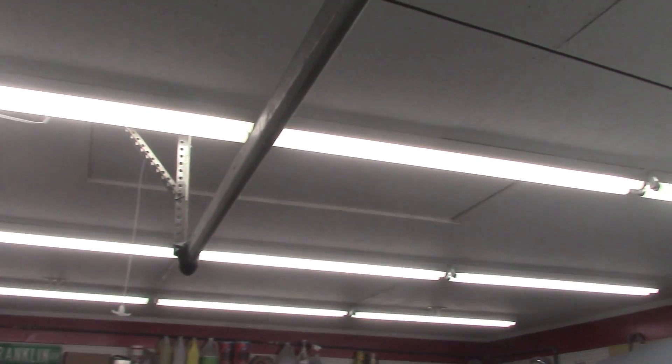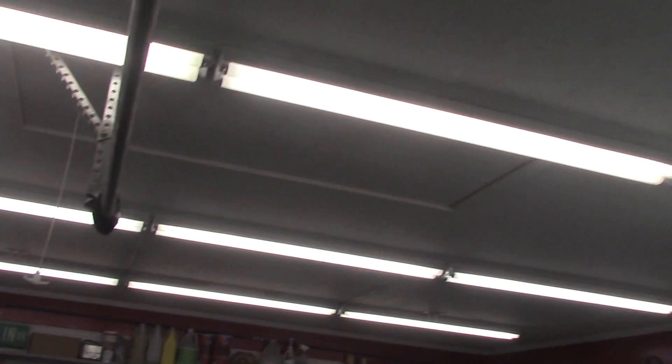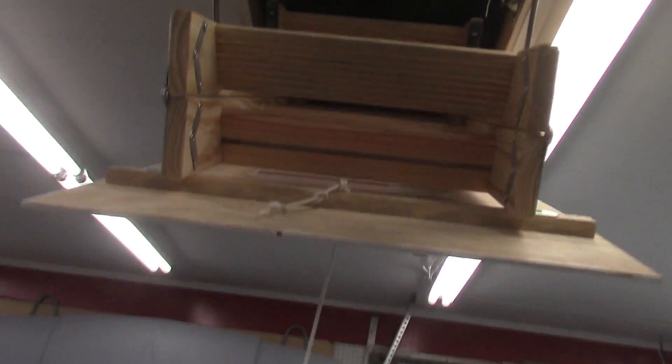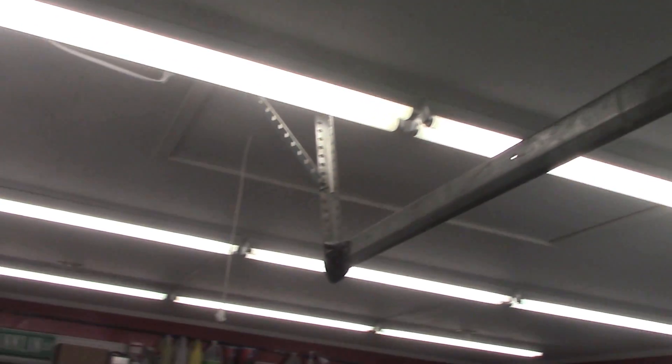What's up y'all — been real busy at work lately. Done a few things around here: went on and put a ceiling in — it was just trusses up to the rafters. Ran some plywood, ran new lights, ran my insulation first, then done some fire-rated plywood OSB, put a pull-down in, and ran all new lights all the way around. This really helps keeping that AC in there.